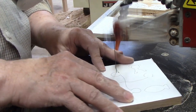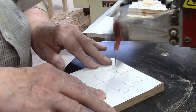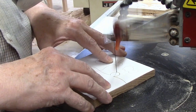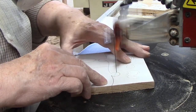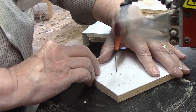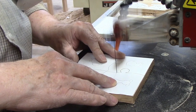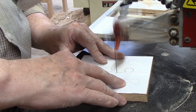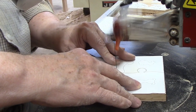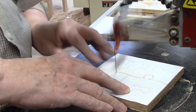I followed the cut line to where the loop for the puzzle came up. The best way to make tight turns is to cut right up to the point where you need to change direction, then back the blade up a tiny bit so it is no longer cutting, but keep the blade running up and down. You can then use the curve you just created to gently turn the workpiece until the front of the blade is pointed in the direction you want to cut next. The tip of the blade will nibble away just enough material to make the turn. Then start cutting in the next direction.